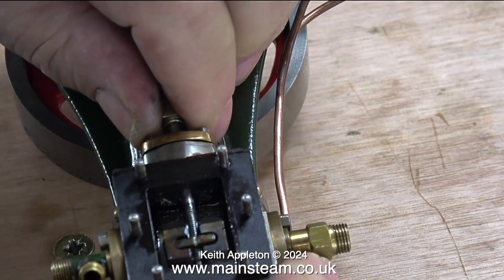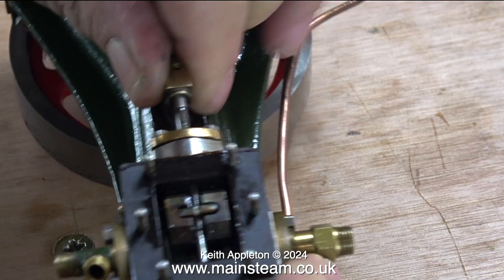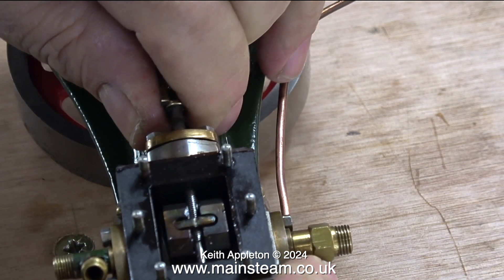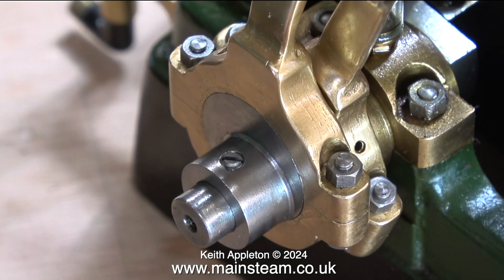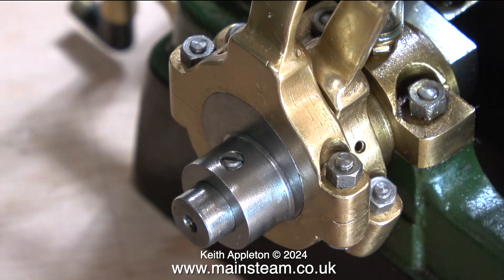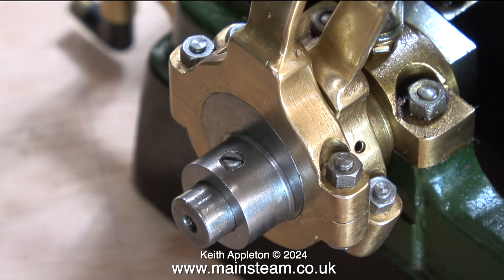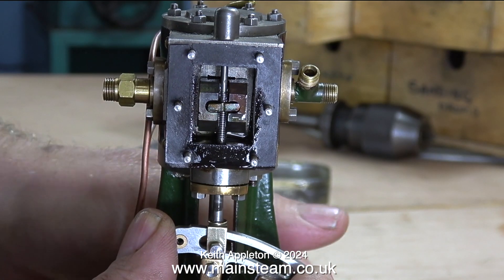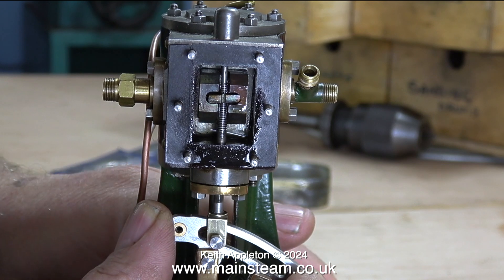Because a lot of this valve fork is threaded, I can't just push it into the valve gland — I'm screwing it in, so the valve packing material won't be damaged. Moving down to the bottom of the engine, it's now time to set the eccentrics in the correct position, or at least the approximate correct position. I'm fixing them in position with the grub screw, with the flat side of the crank web corresponding to the largest lobe of the eccentric.